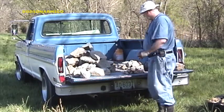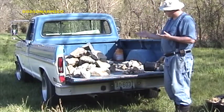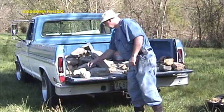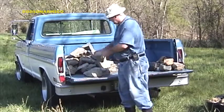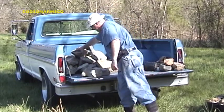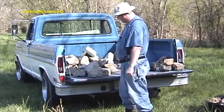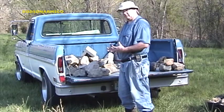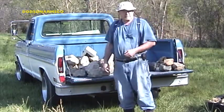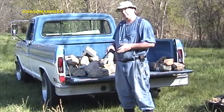After that, we'll put a landscaping barrier on top to keep field dirt from going into this material. The reason you don't have to compact this material is when you put this stuff in, the rock sits edge to edge and gets its stability from that. It leaves voids that allow water to percolate through — it's a giant version of a French drain and it'll maintain your stability. When we cut the channels and put the pipe in, we'll install this, show you what it looks like, then put a layer of number one riprap on it, then the 57.